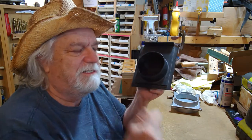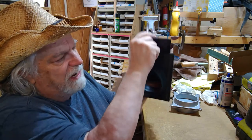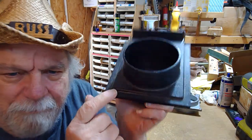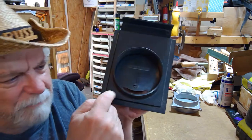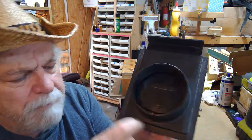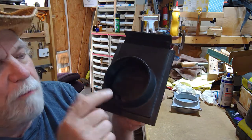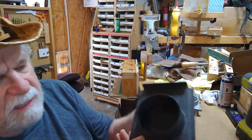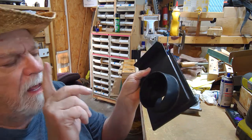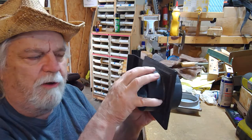The plastic one is not bi-directional and the metal one is bi-directional. One thing you should know about the plastic style is what makes these a problem — why most people really hate them after a while: dust builds up in the pocket at the very bottom and eventually the gate won't close because it hits against all that piled-up dust. I drilled a big hole here and here — about a half-inch or 9/16 hole — and that helped keep some of the dust out, though it still tried to build up.